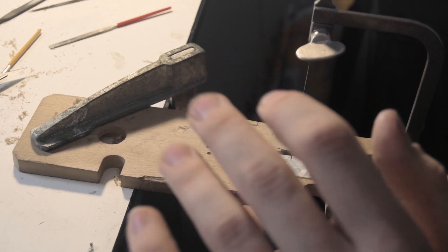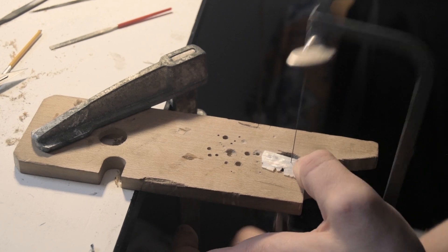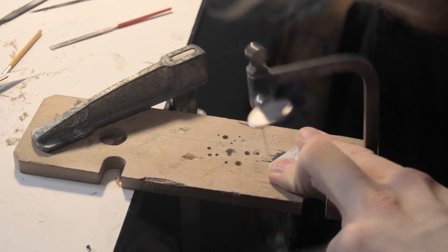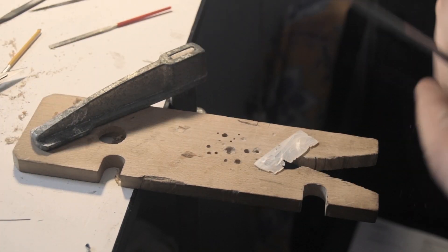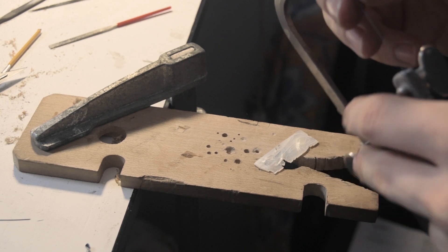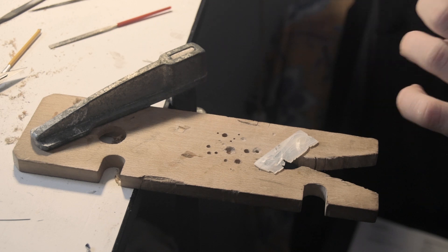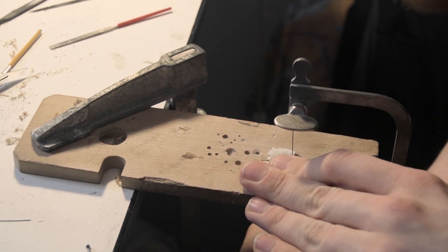I should note also that you don't want to breathe in pearl dust — it is pretty carcinogenic, so try not to breathe it in. A little bit of a twist and the blade broke. No matter — we'll move along with this blade until it breaks again and then switch over to a new one. Blades tend to break off quite a lot once they start wearing down. With a new fresh blade, the cut should also be pretty good. Always make sure that the teeth on your blade are angled down — that means that whenever you're pulling down, you're cutting. A good way to tell if you have enough tension on your blade is by the sound that it makes.